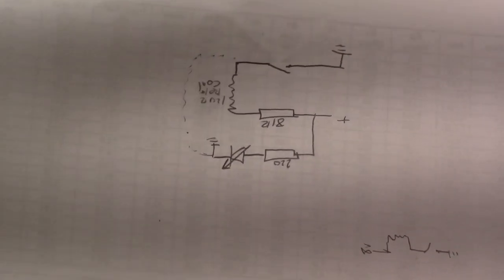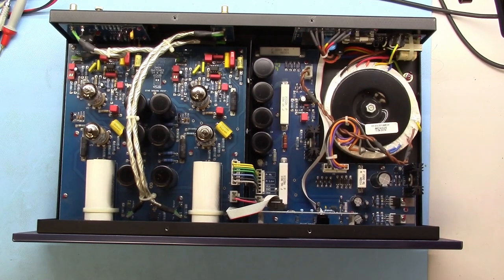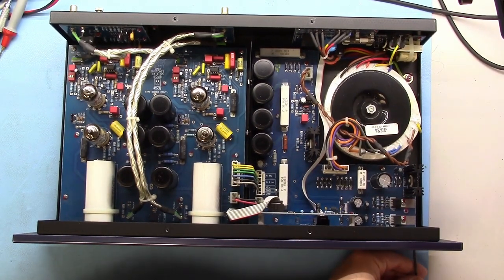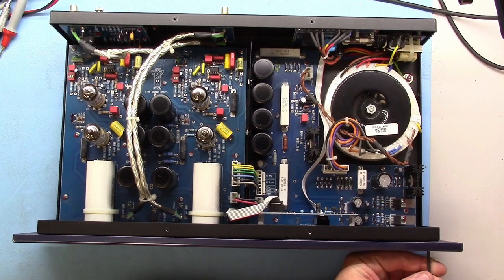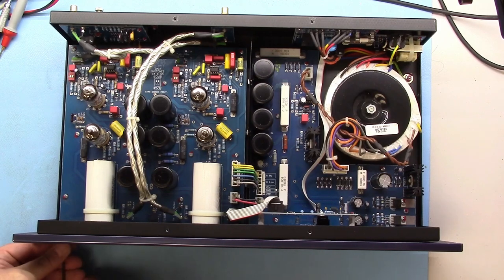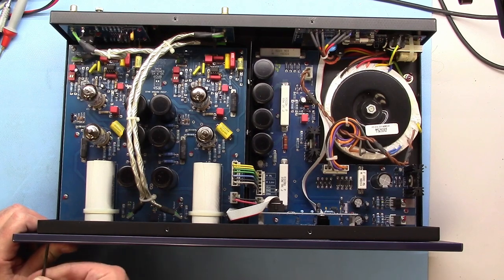It works fine, but it doesn't have the annoying blue glow while it's plugged in, until you power it on. Let me get the panel off, and then there's just a couple of screws to get to the power switch, and it's cut one trace on the board and add one little tiny jumper wire. It just couldn't be really any easier. And it's reversible, should you want to do so. You could just undo the jumper wire and jump it back to the ground terminal where it was.